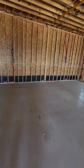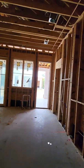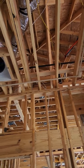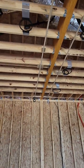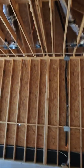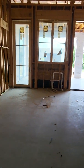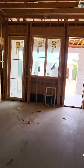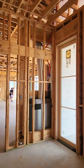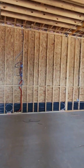This is the game room slash media room — this room is going to be really cool. We have this entire room wrapped with LEDs to give it a low-lighted feel. The owner wanted a speakeasy feel, a dim view. He ended up putting can lights in last minute, but this room was originally just going to be LEDs. We're going to be able to light this up with red, green, blue, fuchsia, whatever color you want, as well as tunable white. If they want 3000K — a yellowish soft light — they can, or if they want 5000 or 6000K to light it up bright like a big box store, they can do that as well.